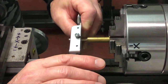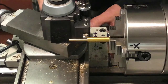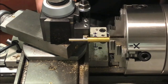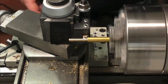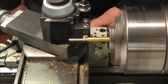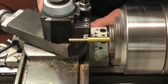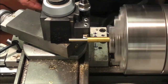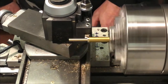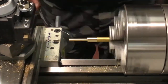Check our measurement for our lead and where we're going to thread. Bring it in and just face off that shoulder a little bit more there. That should bring us pretty close to our one-seven-hundred thou. Now we'll run a pass down the larger diameter area where we're going to do the threading — we'll have to remove a few thou there as well.